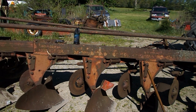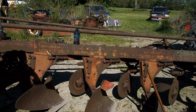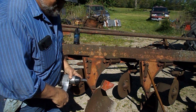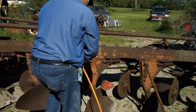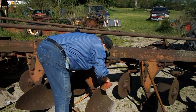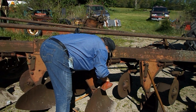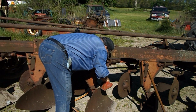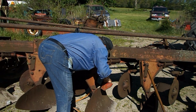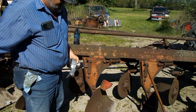The gauge wheel will work fine. Trail wheel, no. Should have had originally probably a 7.00-14 implement tire on it, and well, nobody wants to buy them new, so they just chuck them off and put a car tire on it, which will work, don't get me wrong, but not exactly the best thing. So, I'll be back here in a bit, guys. Hang on.